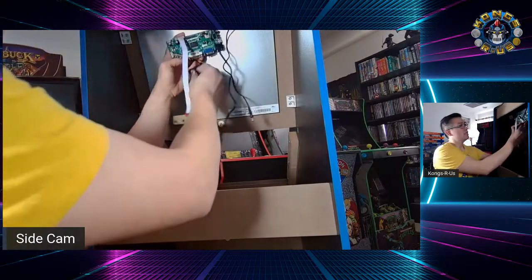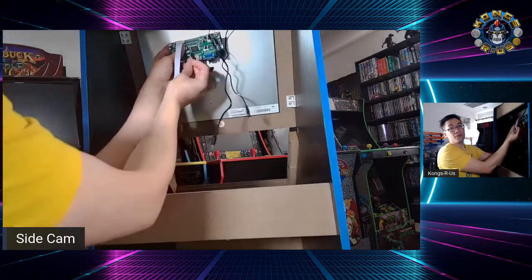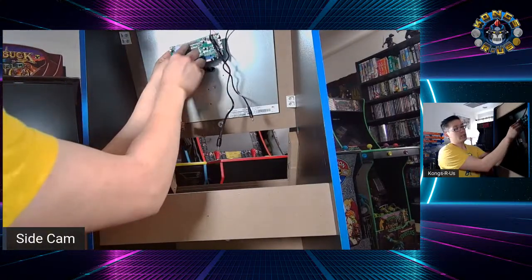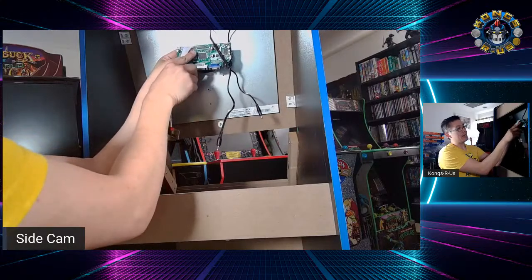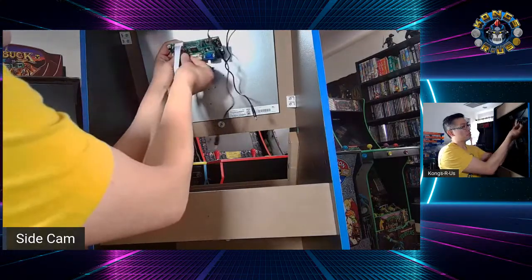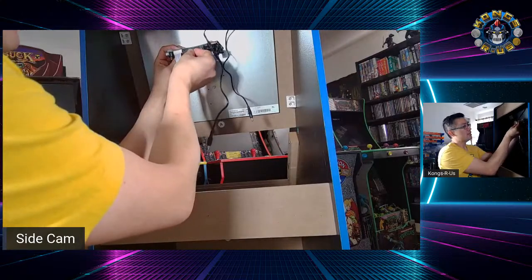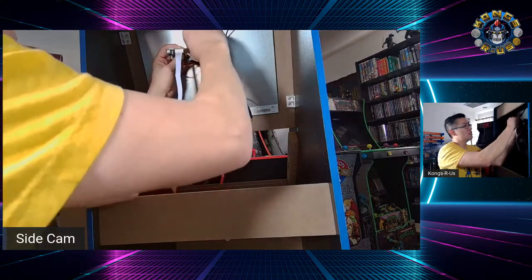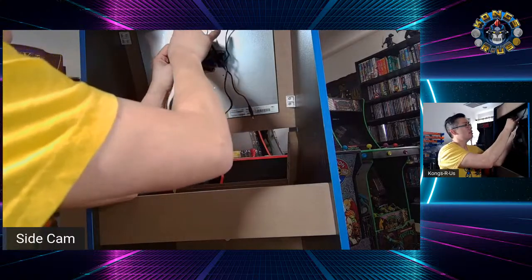And then this is the cable for this one. The red wire here needs to go on the left side of your LCD display adapter. There's a little arrow right here, so it should go on the left side of the pins. Make sure you line up all your pins nice and accordingly. The 30-pin adapter, press it in straight. Should be nice and snug and secure.